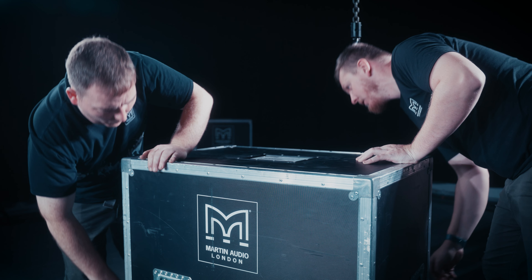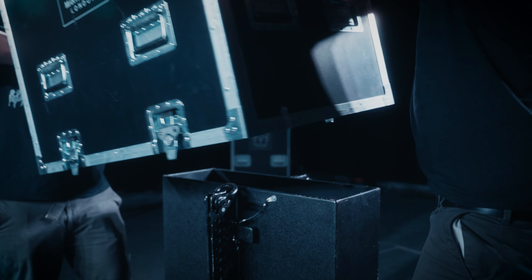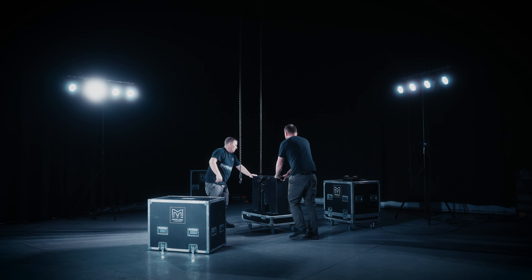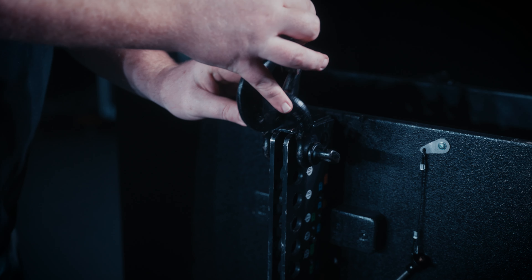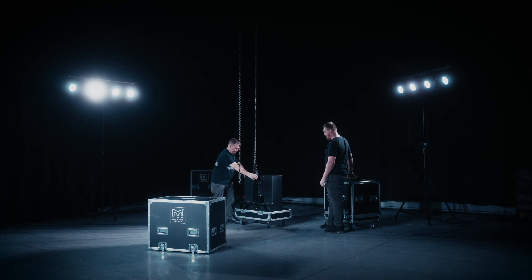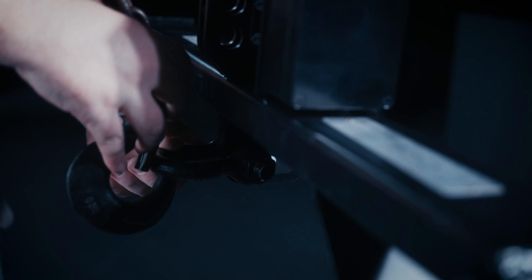To begin rigging a WPC array, remove the WPC grid tee from its flight case. Position the flight case under the rigging point, connecting the rear motor hook with a shackle to hole 20. Raise the flying grid out of the case to a working height, allowing you to connect the front motor hook to a shackle on hole 1, to achieve a two-point lift.